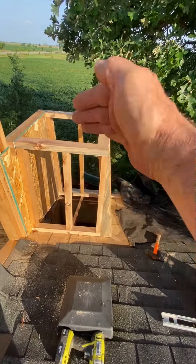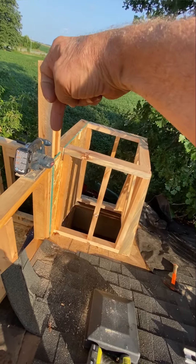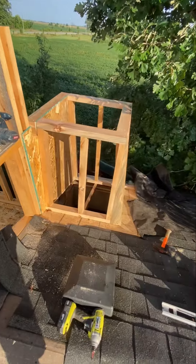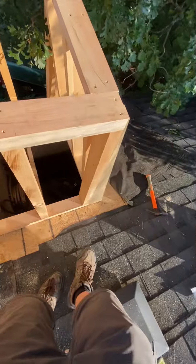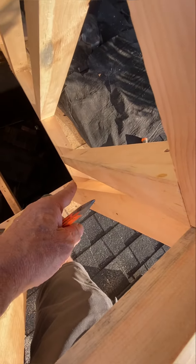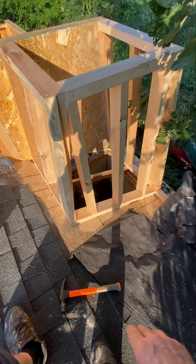I just left this plate at the square length and left that one long, and I'll just cut that off with the fine tool. But I'm ready to sheathe that in. There's a bit of bracing underneath I have to do, but we're properly pitched all the way around, sitting on the roof. So now we're pitched this way, this way, and this way. And as I said, the remainder of that pitch has to go on that other roof — because had I started the pitch down there, it would open up a gap between the wall. You can't do that. I also want the bottom to wrap around the corner, so I have a terminating corner. In my opinion, that's the proper way to place certain objects. The top is perfectly square, and you can see it's a little wider at the bottom, maybe by about four inches.